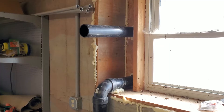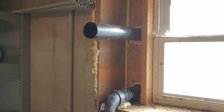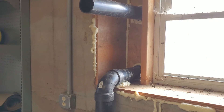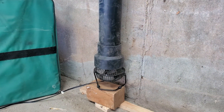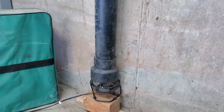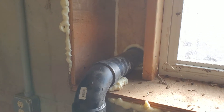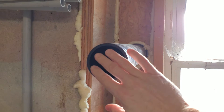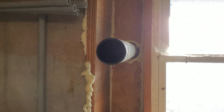Let's take you inside. This is just a shop I'm using this on — there's no insulation on the walls, the walls are really thick so there's a lot of thermal mass but not a high R-value. This is the return down here at the bottom, and just for the purposes of this video I put a cheap four-inch fan here to show how that changes the heat of the air as you increase airflow. This is where the hot air comes out, and right now this is 100% passive — there's no electricity, the fan is not plugged in. This is at about 2 p.m.